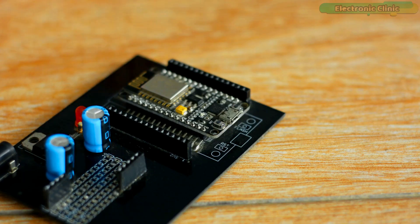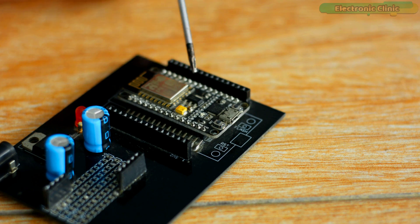The VCC and ground pins of both modules are connected to the 3.3V and ground pins of the NodeMCU ESP8266 Wi-Fi module. Here is my development board which I use for testing my IoT-based projects — if you want to make the same board, watch my previous video; link in the description. Now let's work on the Blynk application for monitoring the temperature.